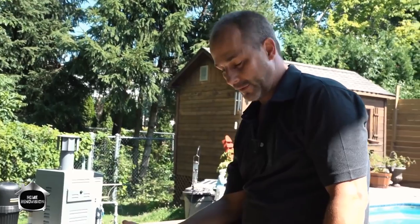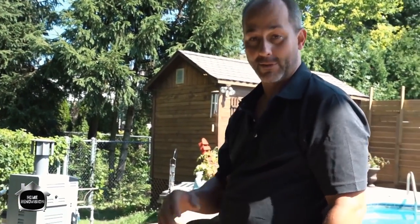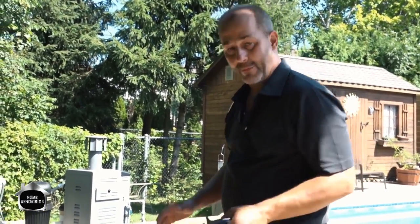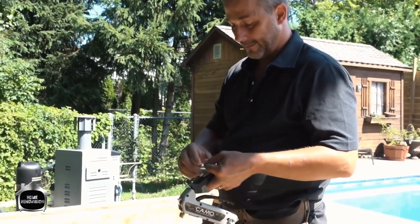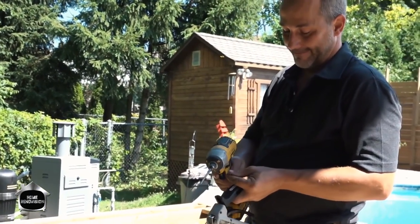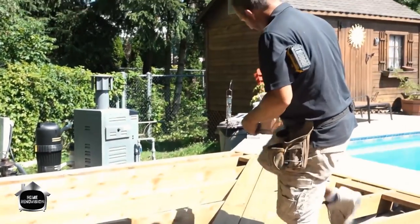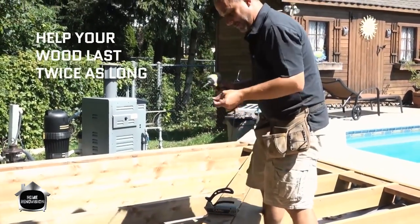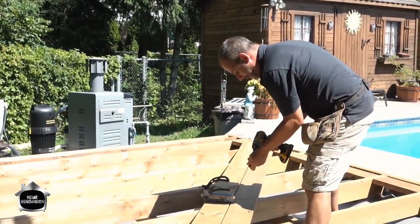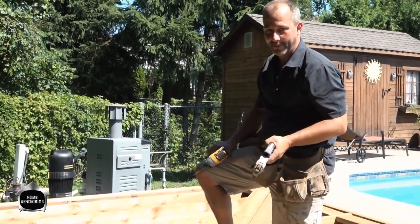Compared to other screwless systems, this is incredibly fast. Traditionally you had to put in brackets attached to the joists, crawl underneath, and screw from underneath — really time consuming. This is really fast as far as a screwless system goes; it'll run you about twice as long as traditional screws, but if you're one of those guys who likes to use an air nailer, that's obviously the fastest way, just not very pretty. As far as performance, this will outperform any screw or nail on the market and help your wood last twice as long — and that's a conservative estimate. If your wood lasts twice as long and it only takes 50% longer to put the boards on, you're way ahead because you don't have to rebuild the deck in 20 years.